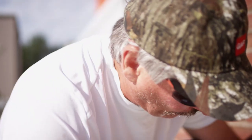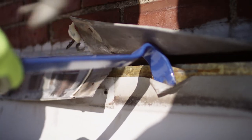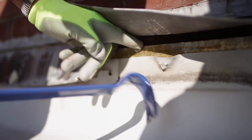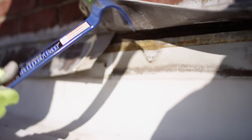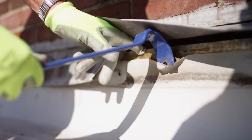Another issue on the roof - this could be another reason why this roof's leaking so bad. The water could be getting down behind that flashing. I don't know why they have this piece of metal in here; we'll find out when we get it torn off. This is actually glued to a piece of metal, and as you can see, that metal is loose. So if water gets in there, it's going to run down behind everywhere.